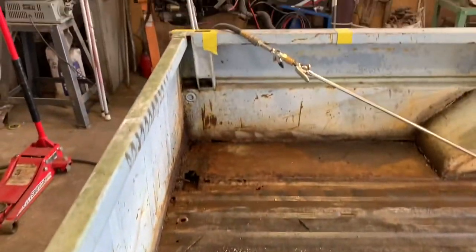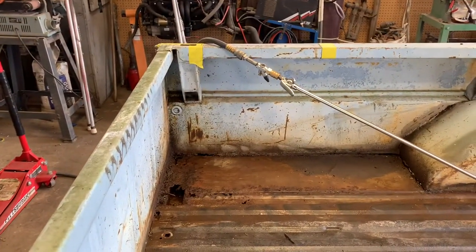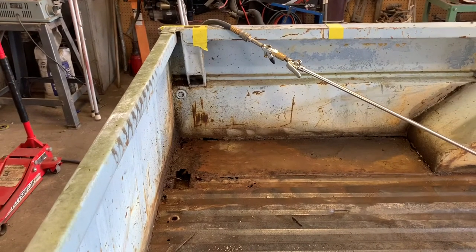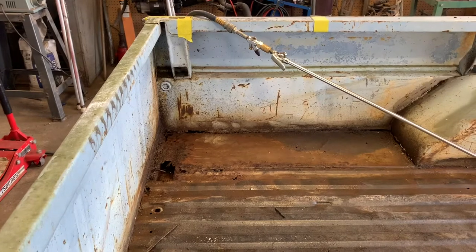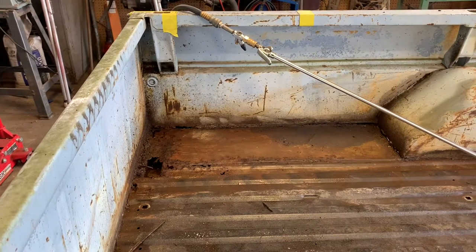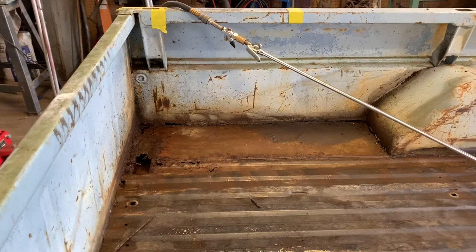And weld that back in, and then all you're doing through that whole system is welding those plug welds back in. Now you have to do a little step work on the inside of the bed there too, because you want to save that factory plug hole for where the chrome molding goes on. But it's still not that bad. You wind up with the minimum amount of seams to have to weld. The same thing on the back.